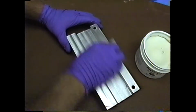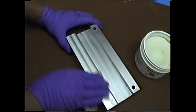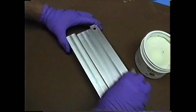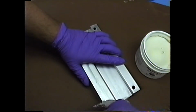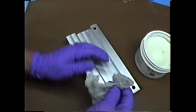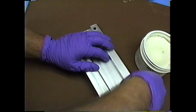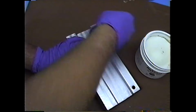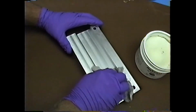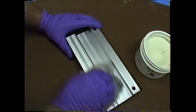Now, I don't want you to confuse this, for people that might not be aware, there are thousands and thousands, maybe even more, formulations of epoxy that are made for specific things, like SIG epoxy glue. All products that are 2 parts and you mix them together are toxic. They're not good for you. In small amounts, they're not going to kill you. Some people are sensitized to it, some people aren't. But there is no such thing as good epoxy. Epoxy is not good to breathe. It's not good to get on your skin. It goes through your skin, certain types.